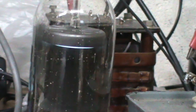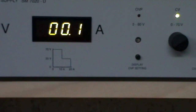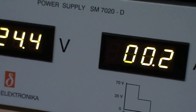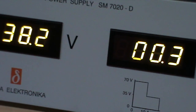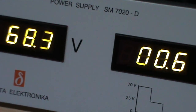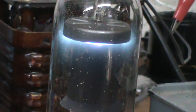You would have thought it would probably take something like hundreds of volts — 600 up to 1000 volts — to get it to light. But not the case. Basically with these, it's the current that's important. The amount of current is proportional to how bright these things glow. So let's crank up the voltage a bit more and the current — now up to 200 milliamps, 300 milliamps. Let's go all the way up. This thing will go up to 70 volts. There we go — 72 volts, 600 milliamps. Look at that, that looks quite cool. That's a mercury vapor rectifier in full throttle.